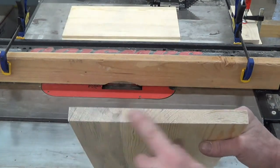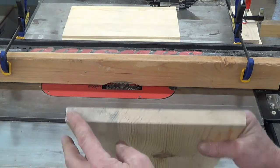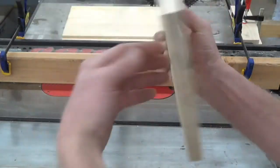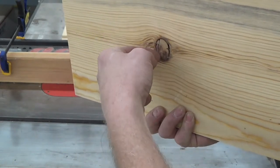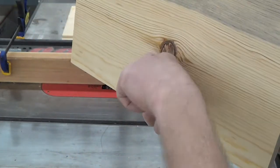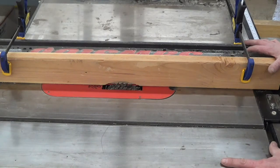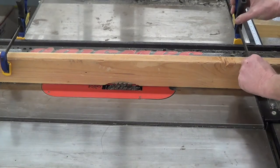Here's another piece with similar grain — I'm going to want this down at the bottom, so I'll put my rabbet up here. When determining inside and outside, I notice there's a knot here. If this is on the outside, that knot runs through the board at an angle and could begin to leak moisture in that direction. If I put it this way, it will shed water out. So I'm going to put this on the outside. Now that I've got all of my rabbets cut, the next thing is to build the box joint jig. I'll remove the sacrificial fence.